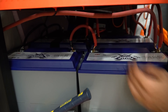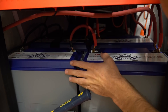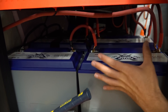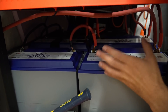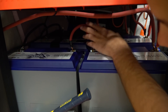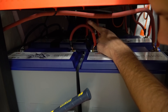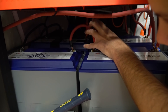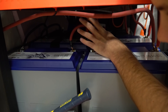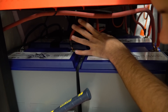We're only pulling 6 amps from the Lion Energy pack. Even though these are wired properly, we have different capacities and different age batteries. But for this large of a pack at lower loads, these will cut off at practically the same time. We're pushing 7 amps through 2-gauge wire — that's complete overkill. Current sharing is technically a problem here, but for small loads and trickle charging with solar, I wouldn't worry about it. If you're trying to push the entire pack's capacity at a very high rate, such as charging a Tesla with split phase output, then you're going to run into some current sharing problems.